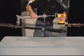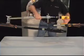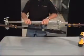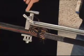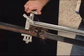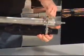Use a wrench or low speed drill to extend the tool. Position the tool on the cable and tighten the clamp securely. Adjust the gripping fingers to fit the splice and lock them in position.